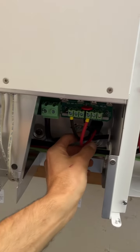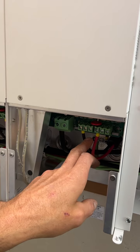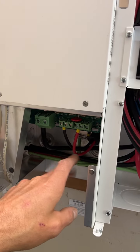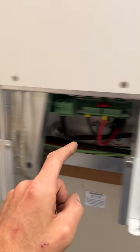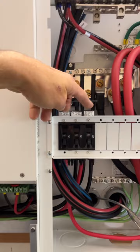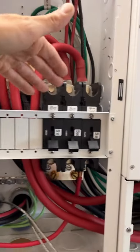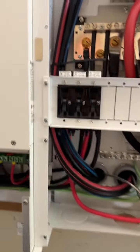The PV comes in direct, goes right to the charge control, disconnects out of the array, and then your battery comes out, like on this guy here, runs through, goes up to my number 2. So again, I'm laying these out. First breaker, first charge, second, third. Likewise on this side, first, second, and third. It just makes flowing sense, I guess you'd say.